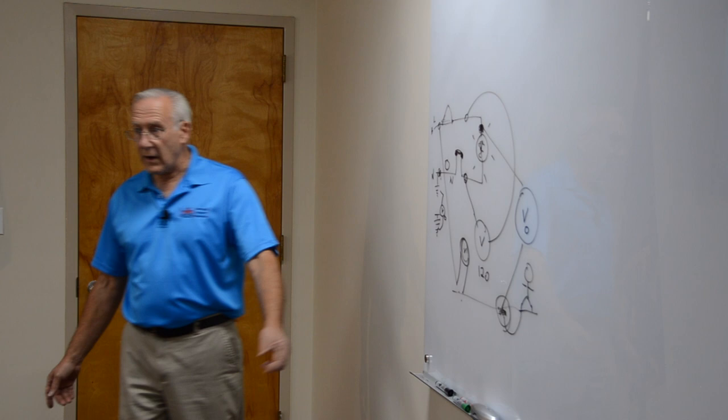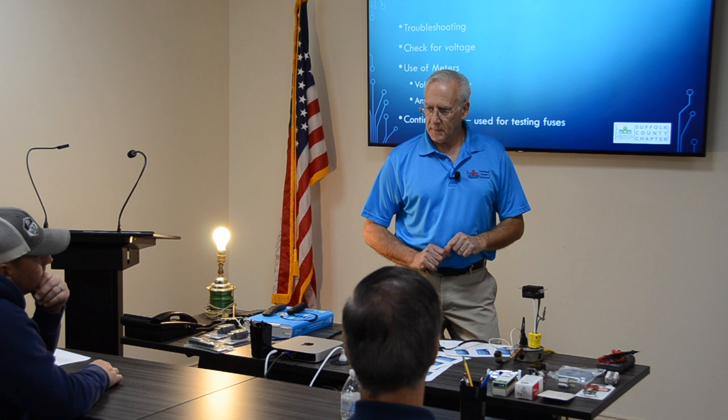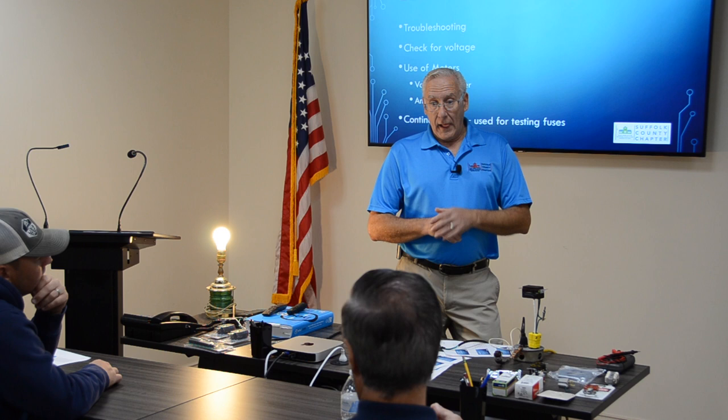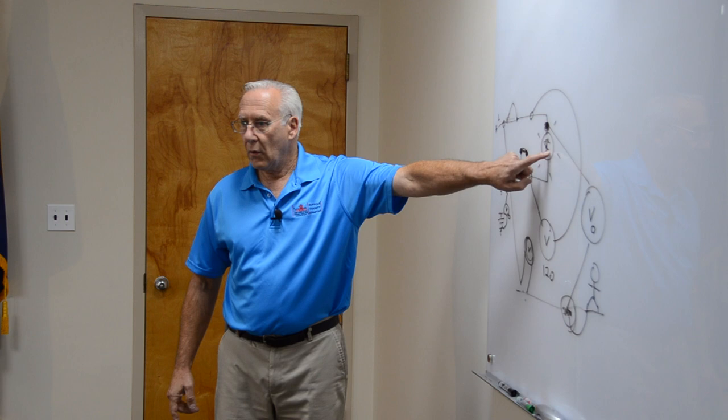Just be careful when you touch it. A neutral is the most misunderstood wire on the planet. And people get in trouble all the time with these things, and this is the reason why. I didn't invent this system. You've got one loose neutral and you don't have anything. That's right, but you have live wires. You have live wires all the way through that bulb, or a motor, or a toaster, or anything that's plugged in.